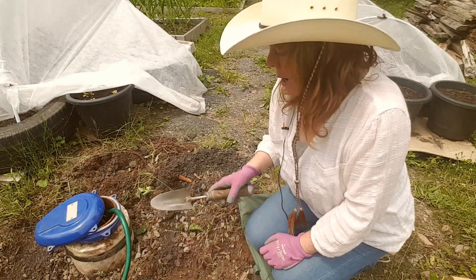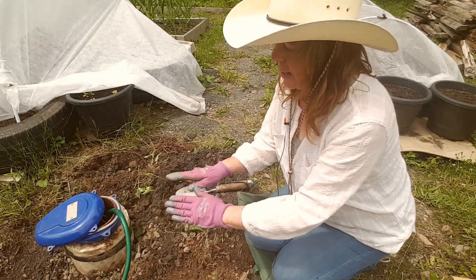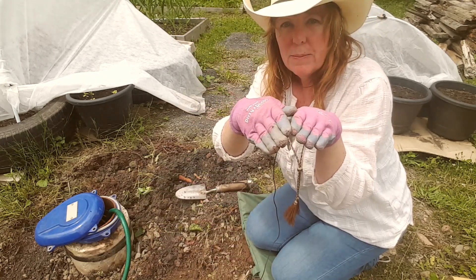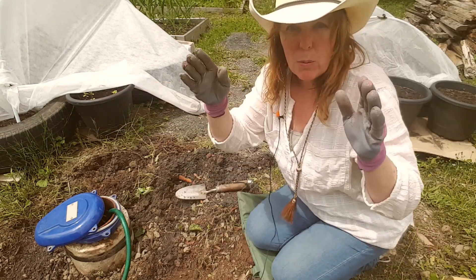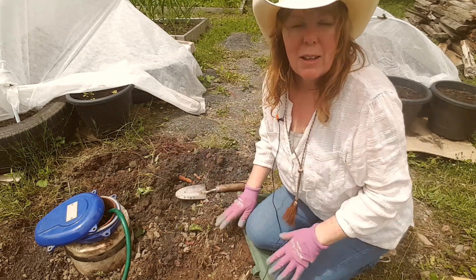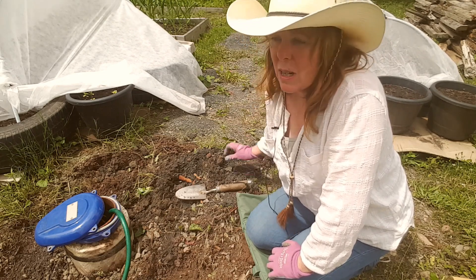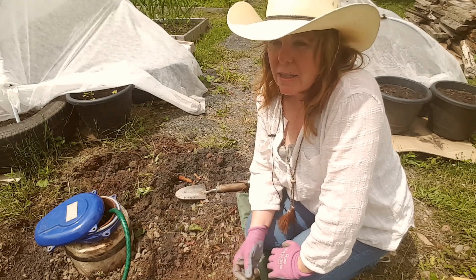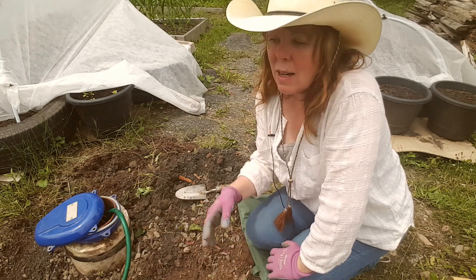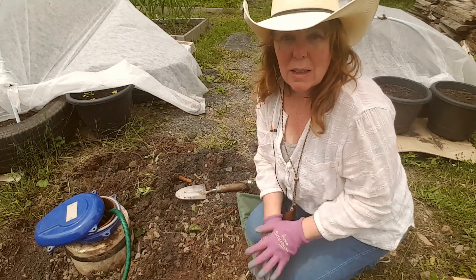While the water is circulating in my well, I'm digging all around the well, because the whole idea is that you want to build a hill of dirt. You want it to start at around 8 inches below the cap of the well and slope down to the ground. That way, when it rains, the water won't go right into the well cavity — it will trickle down and away. The reason you do that is because on the ground we can't help it: there may be pesticides, fertilizers, or if you park your car nearby there might be gas or oil. If you use a lawn mower, sometimes oil and gas gets onto your grass, and all that can be transferred into your well when it rains. So if you hill your well, there's less of a chance of that leaching into the well water.